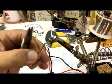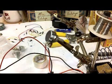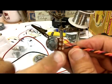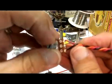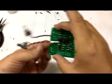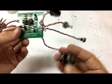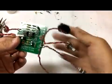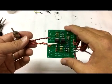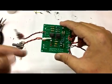Finishing up the volume and the gain pots here. References from this voltage to ground — that's the reference — and the orange wire there is the wiper. This is what's fun about prototyping. We have got the switch for the diodes, the gain knob, input, power, volume, and non-inverting output. I don't have the XLR hooked up yet. I don't have the buffer hooked up to anything or the meter.